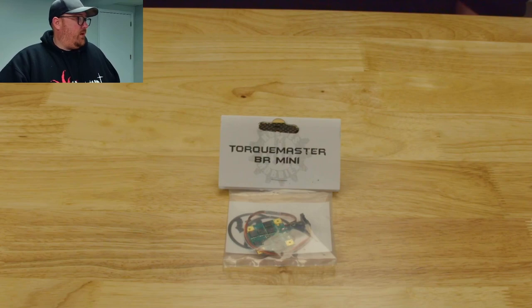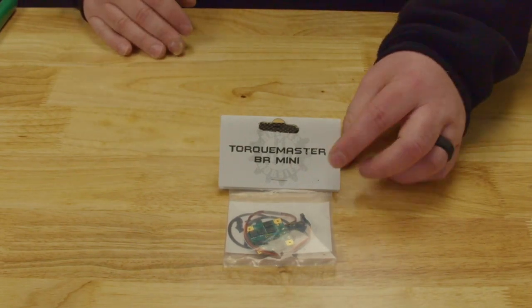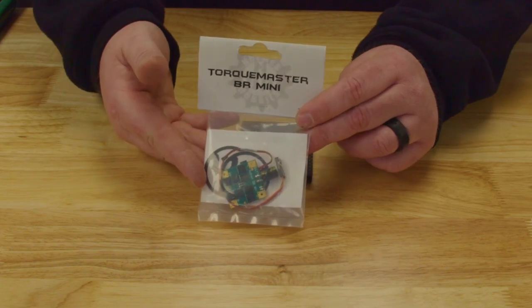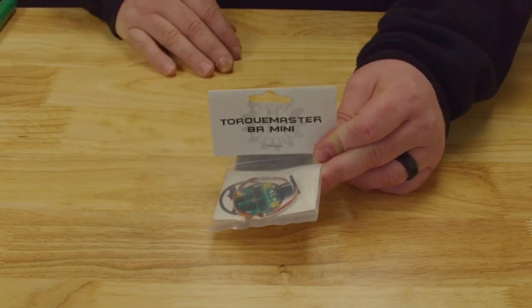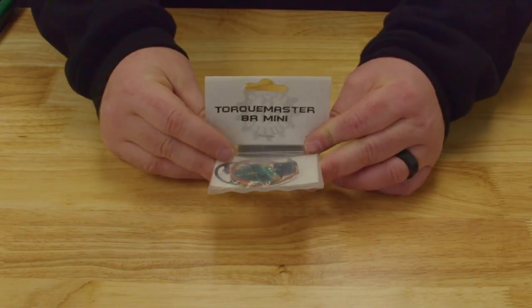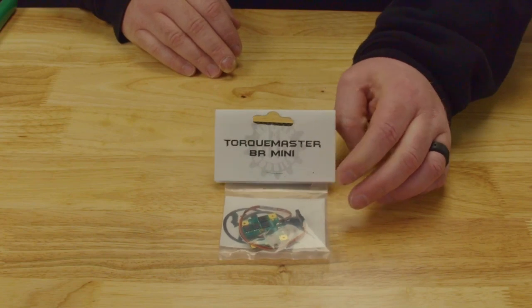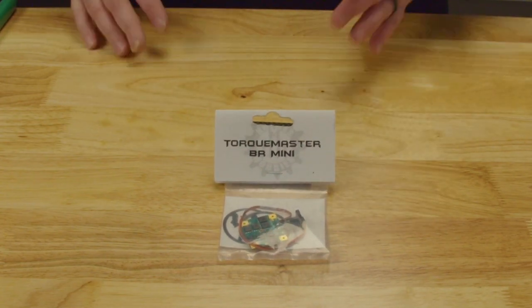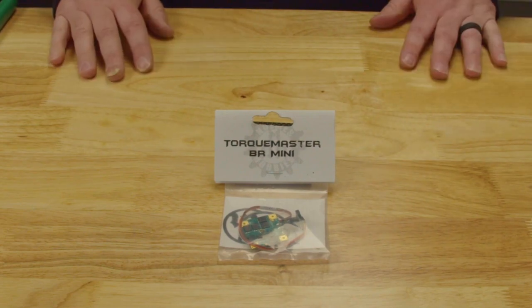I will talk about the tools that I typically use for this process. Obviously, you're gonna need your Holmes BR Mini. It's my ESC of choice. The reason for that is it is small footprint, it's lightweight, it's good up to 6S, no issues on the power wise, but the only problem that you might have or people might dislike is that it does not have an internal BEC. So keep that in mind if this is gonna be a choice selection for you.